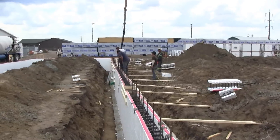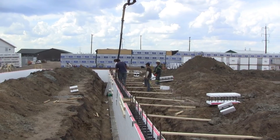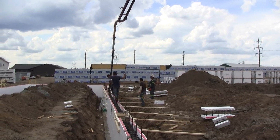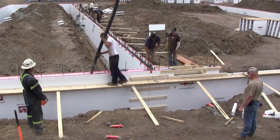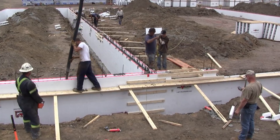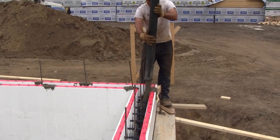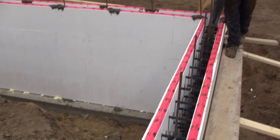We're starting to place concrete. We have a really nice concrete mix design made for ICF construction — it has extra cement content and a mid-range water reducer, poured at 140mm slump, which is between a five and six inch slump. The beam is getting filled right now, eight inches down from the top, all vibrated and consolidated. The concrete is being placed at almost a six-inch slump, and along the footing you can see the interlock is about a half inch off the footing with no concrete escaping at all.